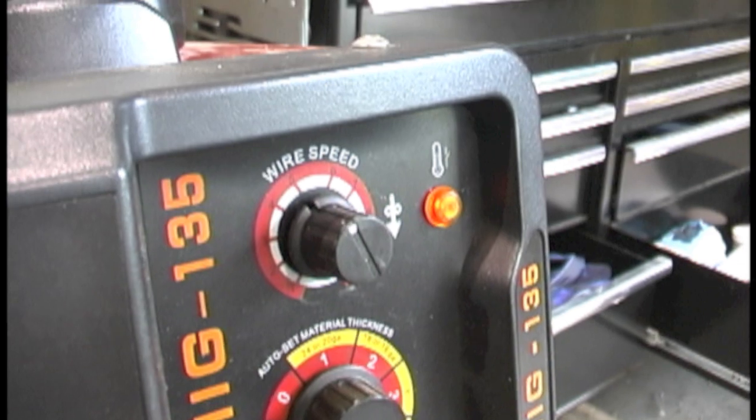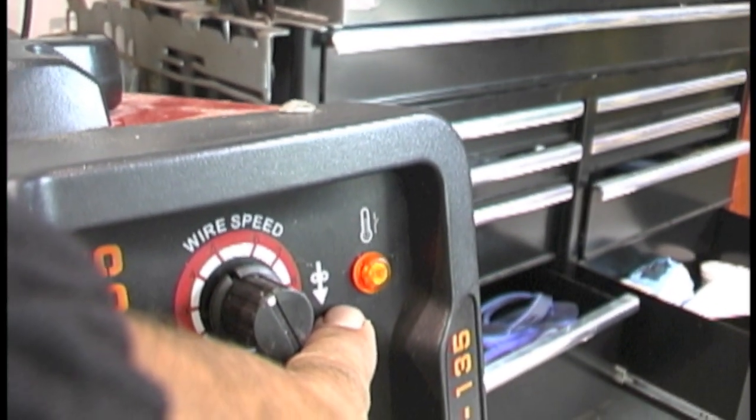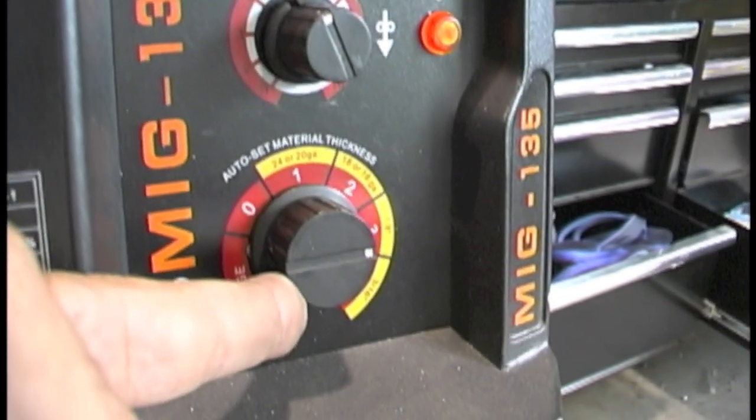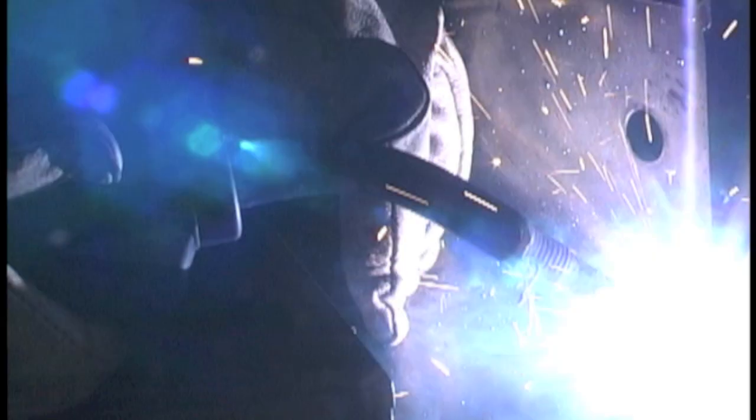About 24 inches into this and the overtemp light came on, even with stopping off to reposition cameras. That's why I wasn't crazy about the welder. It has a decent arc and welds okay — it's kind of surprising what it'll do for penetration into three sixteenths and quarter inch.